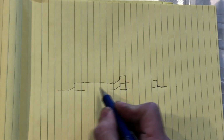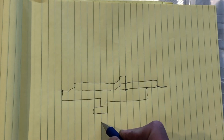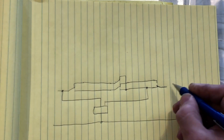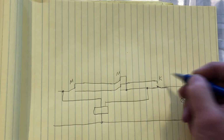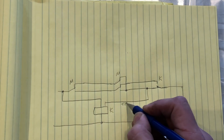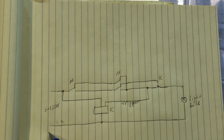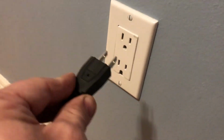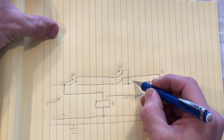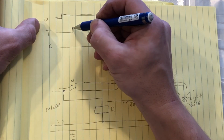The way to wire up the system very closely resembles a 3-switch, 1-lamp system. But instead of third manual switch, the relay contact is used. Trigger signal is taken from normally closed contact of the relay. Initially, the trigger signal in this example is energized and the light bulb is on.